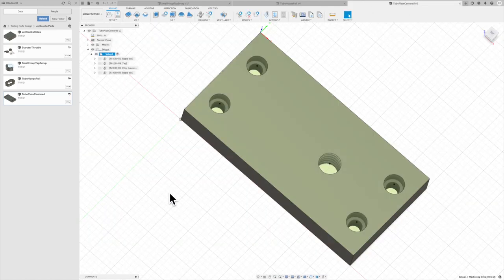Also came down here and designed the plate, so that same thing, I could just cut some 1/4-inch pieces of aluminum, grab those in the vise really quick, and I just laid out where these holes needed to be to drill, counterbore, and then drill and tap this hole through there. So let's go take a look at how these parts turned out.